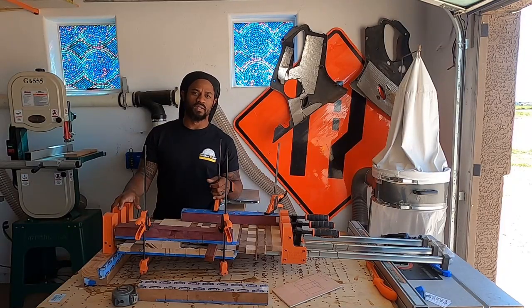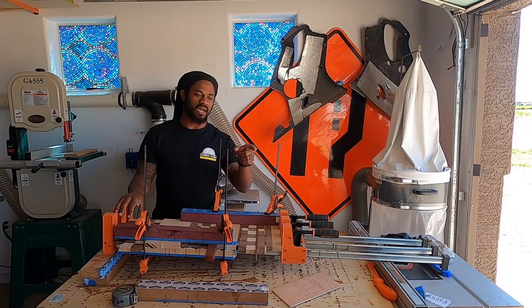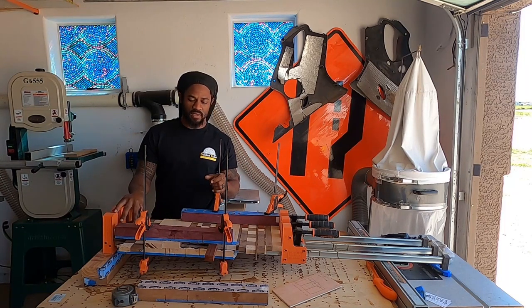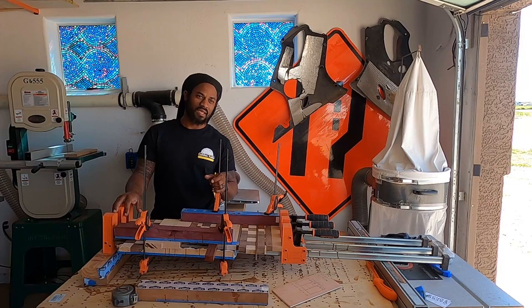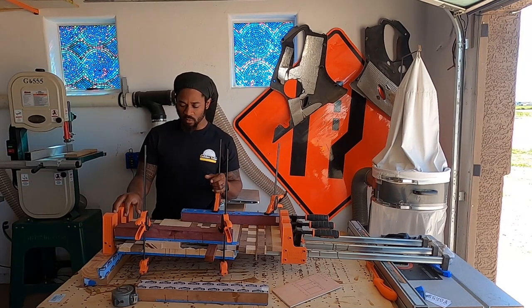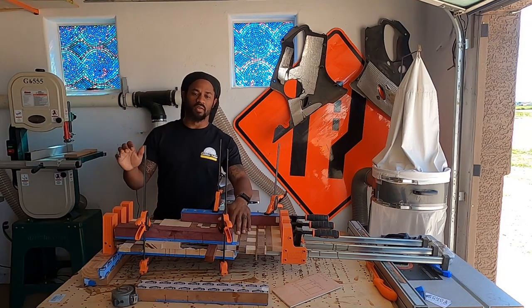These have been in the clamps for a couple days. We've got all four sides and we've got the top over there, so we're gonna go ahead and get these out and run them through the planer. I won't bore you guys with that, I'll just show you after. Then the next step after the planer — I really want to do finger joints but I'm not really comfortable with those and I don't want to mess it up on this project, so we'll try it another time. We're just gonna butt these together, or I might do a half lap — I'm not sure yet.